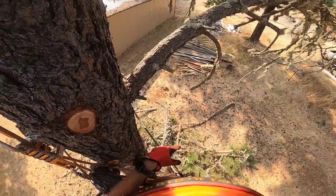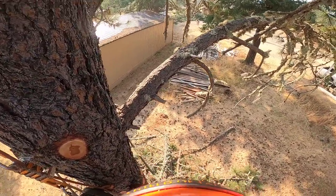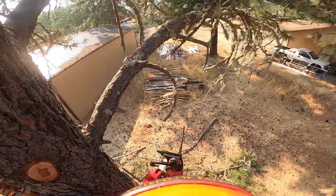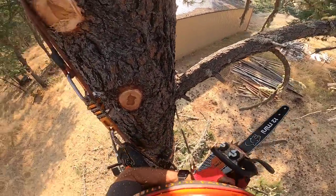I'm going to do a post cut. It's kind of hard to do with pine, but it's doable. So that's a cut here, and then a cut on the side, and then another cut on the side, so that there's just a little post shape in the middle, and that should make it fall flat. It's not always doable with pine because it's so hingy.